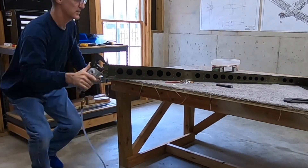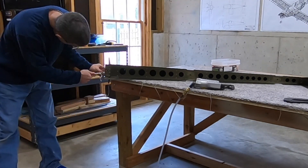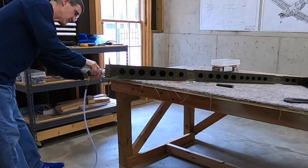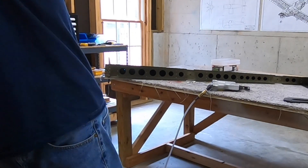That was a place where many weekends ago, when I was completing those steps, I was wondering: why in the world am I countersinking the backside of this thing? Later on in the plans it tells you why — and that's exactly why — because the rivet wouldn't be long enough otherwise.